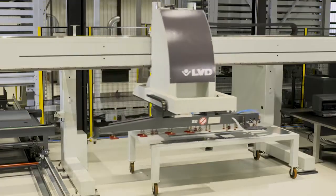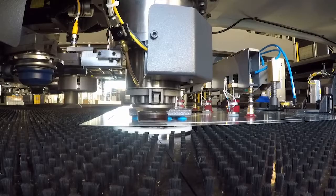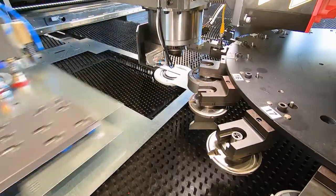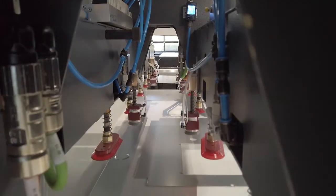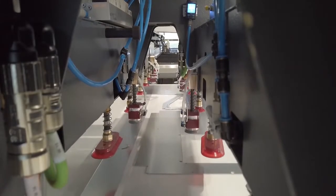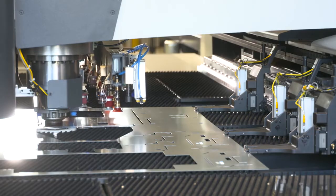The FAP has two separated control grippers and uses a smart move application for stacking the parts. Total 34 programmable suction cups with a stacking height laser system. It is also possible to add magnetic cups for cluster hole parts.